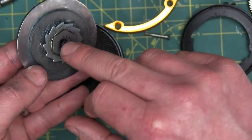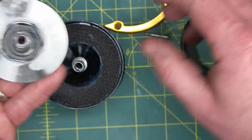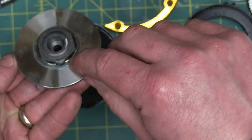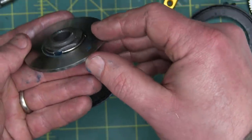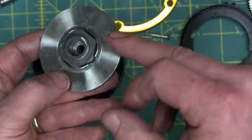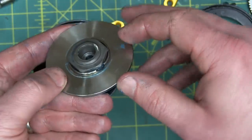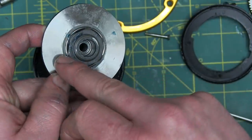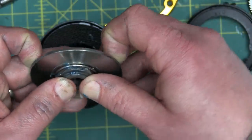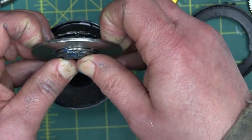This looked like plastic but I had to go at it with a file — it's actually gray anodized aluminum, so that would be die cast. And then there's a little tiny bearing in there. These are kind of goofy arrangements — these bull rings. The problem with the bull ring is it wants to pop out all the time because it's a round cross-section instead of a square cross-section, and it's just hitting on the very nibs.